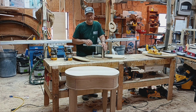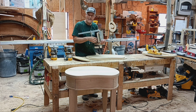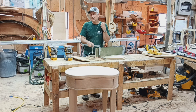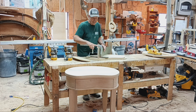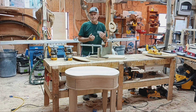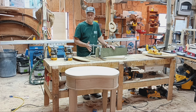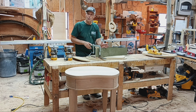I have these metal L-brackets made out of five-sixteenths-inch, six-by-six angle iron, cut with a band saw with drilled holes. I just put them wherever they need to be on the line, screw them down, and on a wide lamination, this is key — I put another piece of metal on the back side to spread the clamping pressure all the way up and down. This metal has to be on there because, especially on a tight radius, the fibers will blow out if you don't have that metal supporting it. Use eighth-inch metal or even a little thinner. On the inside, it gives you a nice even radius — in some instances I was going two or three inches between these brackets.